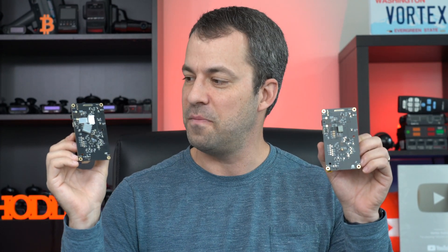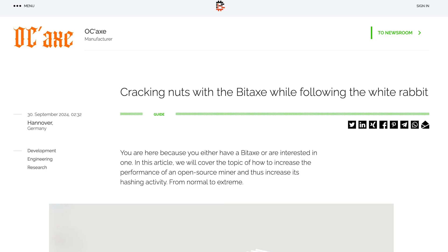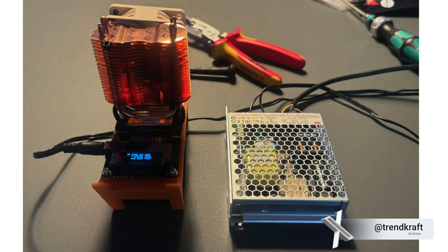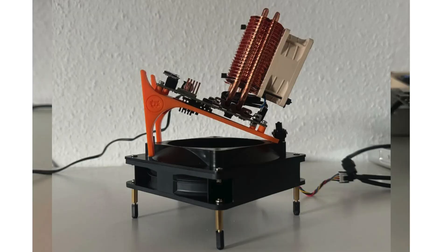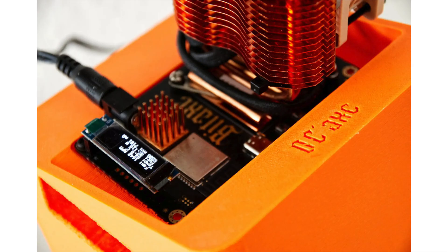There are a couple other components that can also get hot that we don't have the ability to monitor the temperature of directly. So we're going to use a thermal camera to point out some of those components, and then take a look at some options to add additional heat sinks to keep the backside cool and the front as well, compared to what you get with a stock BitAxe. If you haven't seen it yet, this is the best article I found when it comes to overclocking BitAxes and keeping them cool. It was put together by Andreas, who is Trendcraft on Twitter, and it covers just about everything you need to know: overclocking settings, airflow, different cases, and a variety of cooling options. A lot of the information for my video series on overclocking actually comes from this article, so I'm going to link to both my video and this article down in the description.